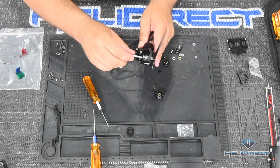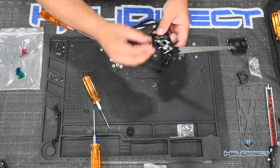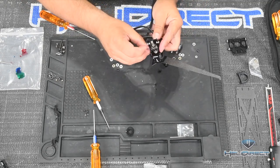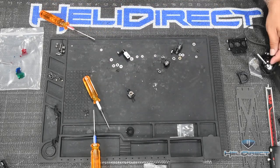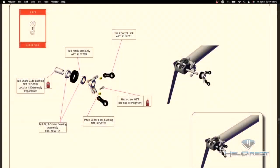So now we know that this rotates smoothly. We know that this moves smoothly. We just felt the tail pitch slider move up and down on the tail shaft extremely smoothly, right? So we know that we're smooth to this point, and we're going to keep sort of checking in like that as we go. The next thing we need to do, let's come back to the manual for a second, is